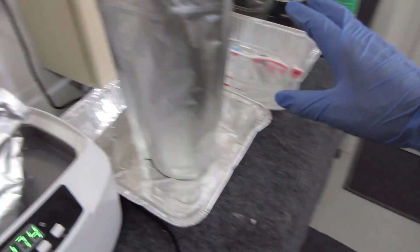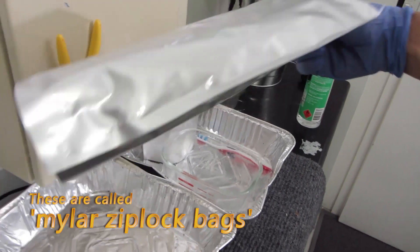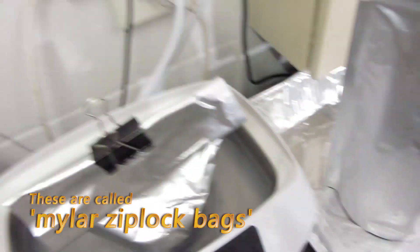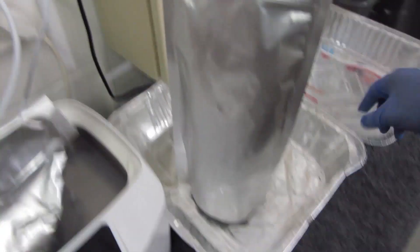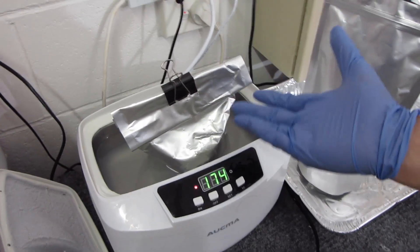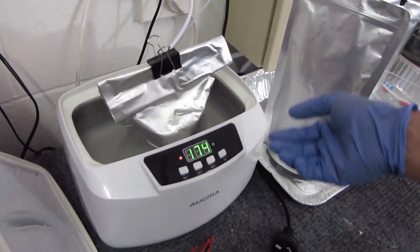That's the tip for today. Go and grab a handful of these — they are called aluminium Ziploc bags, or mylar bags. They are really easy to find. They seal up well, and an alligator clip folded over itself also works great. Forget the glass, forget the plastic, and don't put your IPA or resin waste straight into the ultrasonic cleaner. It causes too much fumes, and the danger is still there that the IPA might catch fire and basically explode. Not worth it.